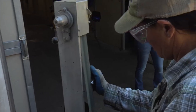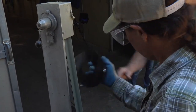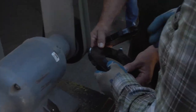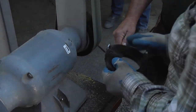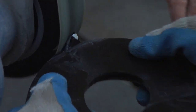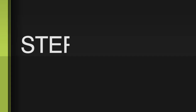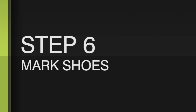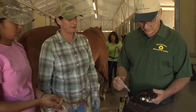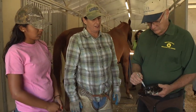Look often — just as parallel to the belt as you can. Just kind of roll it back and forth, just taking the corners off. That's just a round — a little tap there and you're done. I mark the lateral side and I put a little mark on the inside here, so that we know which shoe is for which foot.